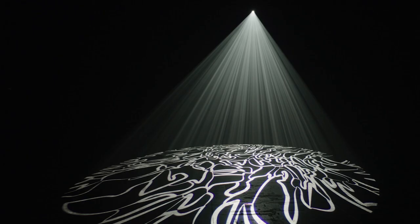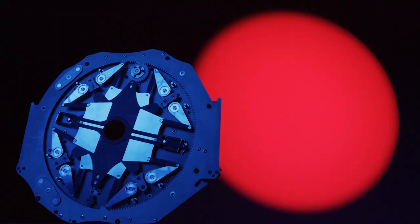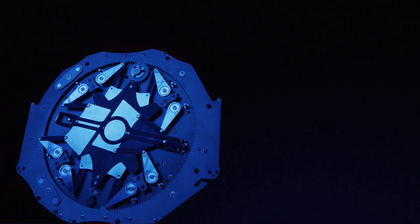Where other systems have no tilting of the shutter blades at the very edge of the beam and only obtain the specified range when the blades are fully inserted, the new Martin Extended Framing system gives you the fully specified tilting from the very outside of the beam and all the way across to the opposite side. This means limit-free full curtain functionality.